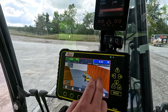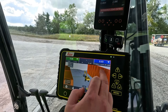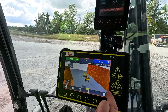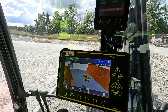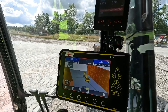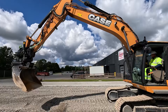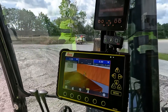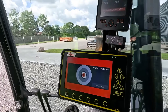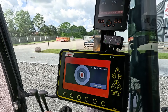Basically what this means — and it's very visual in MC1 — you can see that the curb line in the background has been marked off with a red avoidance model, what we call a virtual wall. What I'd like to do is demonstrate how the machine behaves when approaching that wall. When I slew towards the wall, I will feel a ramp down on the hydraulics and the machine will slow down until we reach the limit, known as the avoidance limit. This means we have triggered the avoidance limit.